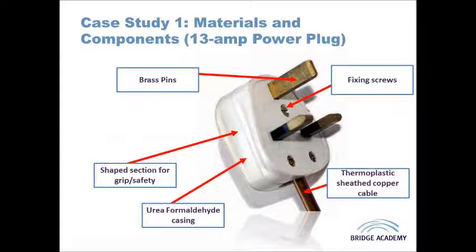The question is why brass is chosen for the pins rather than other conductors. Aluminium is actually a better conductor of electricity, but it is quite soft and lightweight, meaning the pins could wear down over time as the plug is repeatedly inserted, leading to a loose connection and risk of arcing. Copper has a very high melting point and handles high currents well, and is stronger than aluminium, but still lacks sufficient wear resistance. Brass, as an alloy of copper and zinc, has the zinc strengthening and hardening the copper, giving it greater wear resistance and durability. Although not as electrically conductive as pure copper, brass provides a good balance of all the required properties.